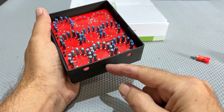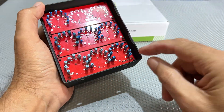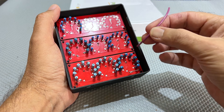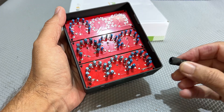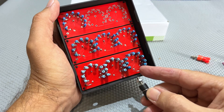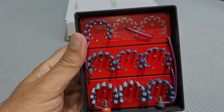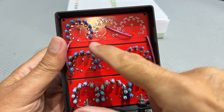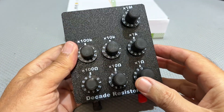You need to connect these boards in series. I've got this one going to this banana socket — that's the end of that one. Then I connect the next board's input to the previous board's output: that one wires to there, that one wires to there, and then that last one comes down to the other banana socket. I had to space this very carefully so these holes actually come through the middle here so the banana sockets fit in there nicely.